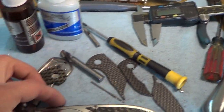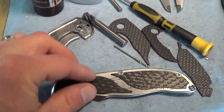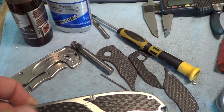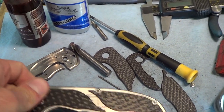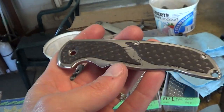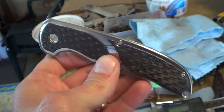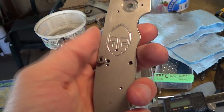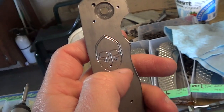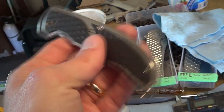These things look so good. I got the tolerances just right so that for the most part they pop right in, and then the glue will keep them in. Look at that — sticks up 30 thousandths of an inch. They'll get glued in place — I'll show you that later in the video once I do it. And then they have little vent holes in the back so that the glue can squidge out of there.